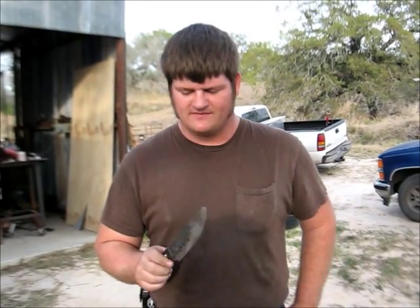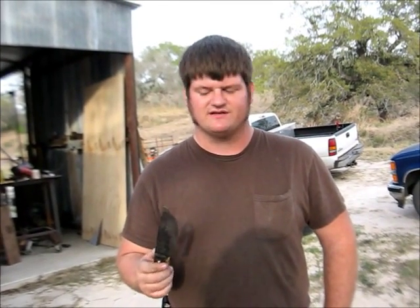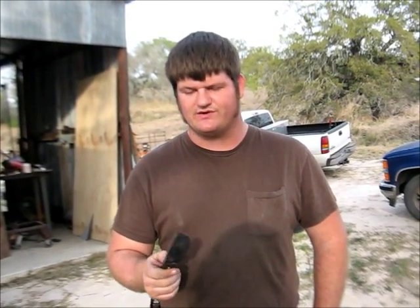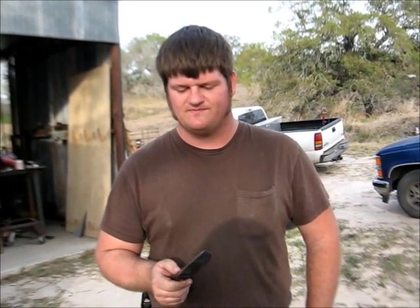Some of the higher end steels, yeah, they'll hold an edge a long time, but they're very abrasion resistant. Good luck getting an edge back on it. You have to work at it. 5160, if you don't let it go too far before you touch up the edge, it'll take longer to set up your stone and your wet rock, excuse me, your wet rock and your strop to get it back shaving sharp than it does to actually bring it to that point again.